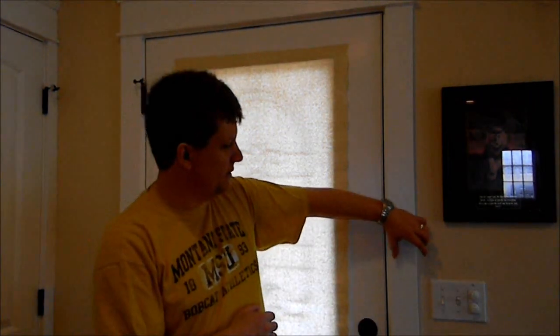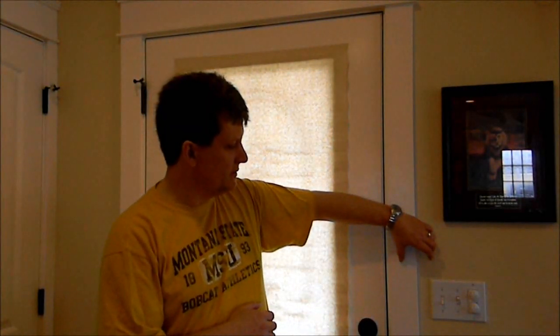While we're talking about home security, you may also want to get enough plywood to do your windows. On either side of your windows when framing a home, you typically have two 2x4s side by side — about three inches — where you can put those framing screws with washers to hold plywood boards over all the windows in your house.